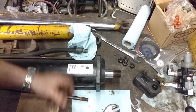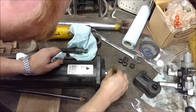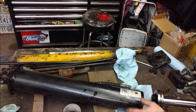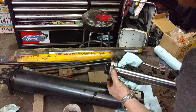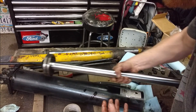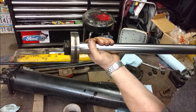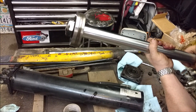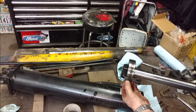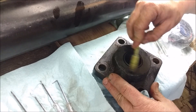I've already cleaned up my end right here and taken a piece of steel wool to make sure there's nothing on it. I'm also going to tape over my threads really fast. There's a seal around here as well — this is your main pressure seal. Fluid comes in this way and pushes it this way; fluid comes in the top of this chamber and pushes the rod that way. I'll just inspect this whole shaft — I checked it before it came out, but there are no nicks or anything else on it. We should be good. This cylinder is actually so new there's really no point in even changing this, but I might do it just for fun.